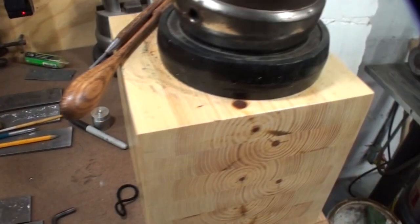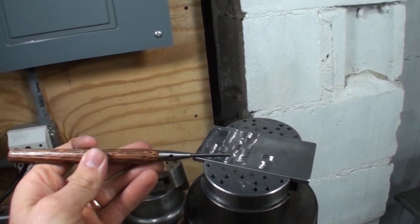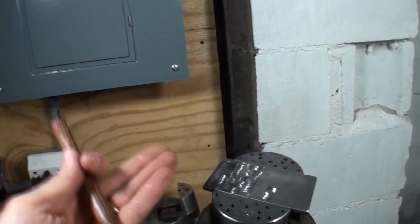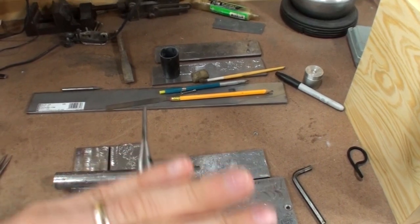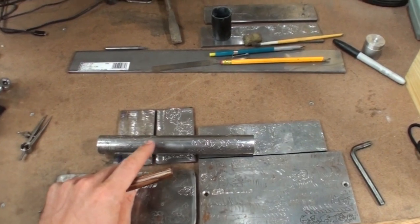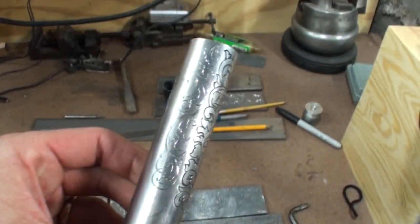So you can imagine, to cut one of these lines, if your tool has to be held at, say, this angle, and it's a curved surface, you're going to have to maintain depth on that surface by maintaining this angle while the surface is actually changing. That's a whole other ball game. You can go from being able to do perfect little arcs with the right amount of lean in the tool, but then you go on to something curved and it's like you're just a beginner all over again. So that's sort of the next level of practicing.